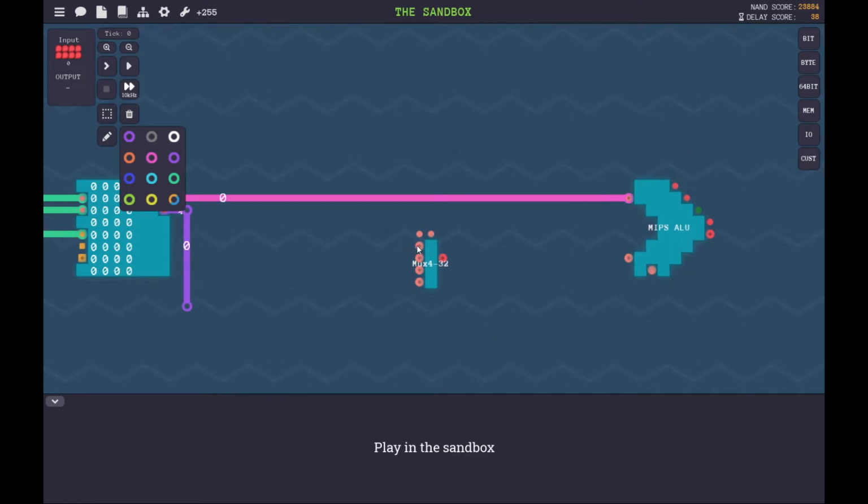And I think we talked briefly in the decoder video about when we use each one. But the important thing is that when all the control signals are off, we're going to take from the B output of the register file. But when the more significant bit comes on, which is this one for this multiplexer component, those are swapped, which was a mistake on my part. When the more significant bit comes on, we want to look at these instead.